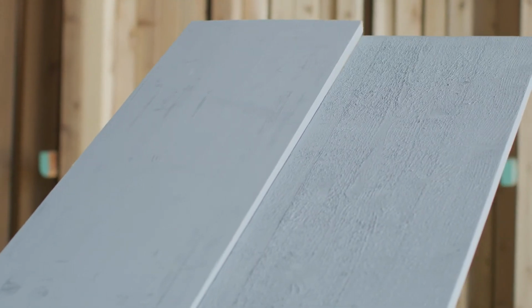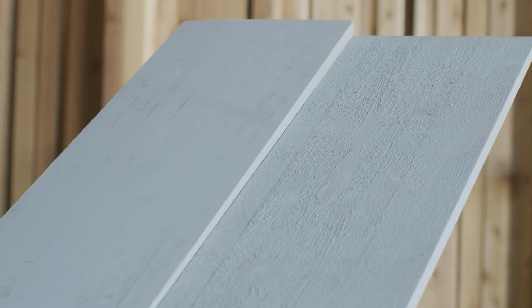One of the primary scenarios that we run into when we have failure of a film-forming finish like solid stain and paint over primer is improper surface preparation. And usually that's caused by the fact that the wood was not pre-primed on all 6 sides before it was installed. The other thing that can lead to coating failure is installing the wood raw, leaving it exposed to weather for 4, 6, 8, 10, 12 weeks, and then attempting to field apply primer and solid stain or primer and paint. You're going to have adhesion problems, and the adhesion problems will be greater the longer the raw siding is left exposed to sunlight and rainfall and dirt.